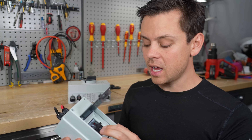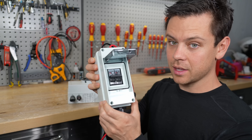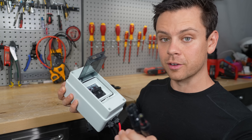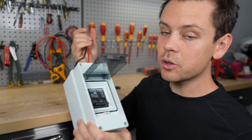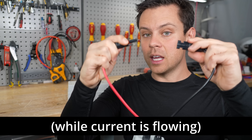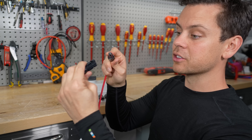Using the wrong breaker means it can melt, be destroyed, or explode. These PV disconnects come ready-built and are relatively cheap. When you connect one to your solar panels and the other side to your charge controller or inverter charger, all you have to do is turn it off and then you can work on your system. This disconnect allows you to work on solar panels during the day safely, because if you were to disconnect with the MC4 connectors directly, you can create a very large arc that can destroy those connectors and lead to failure or worse.